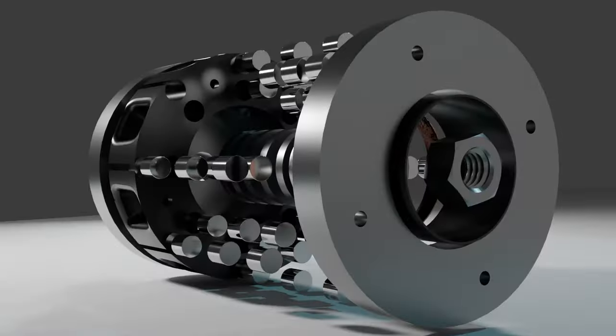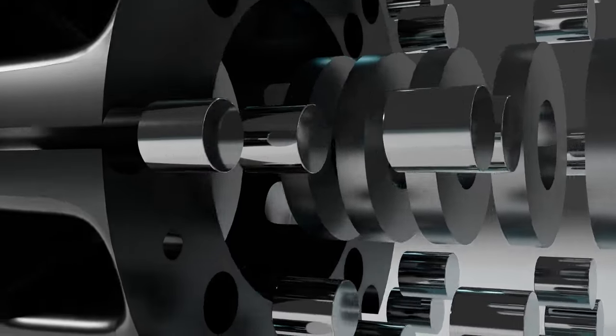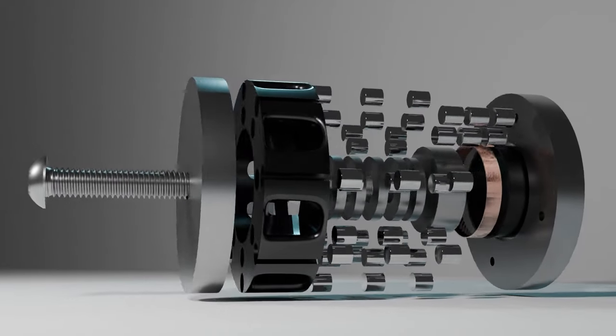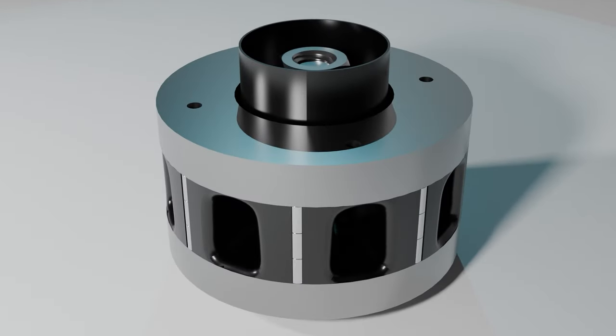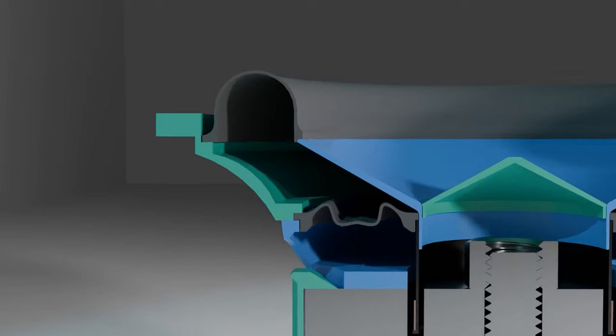The pole uses six small plates and a large, thick top pole plate, as it's cheaper to stack plates than machine a one-piece pole. I'm not made of money, unfortunately, so I do have to do things the cheap way. Everything was assembled using printed guides to ensure concentric alignment, and then it was bolted together with a 3/8 grade 8 bolt. The cross section lets us see a lot about the design.